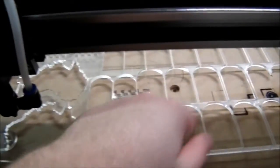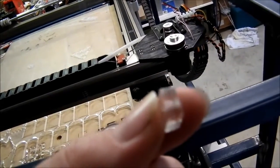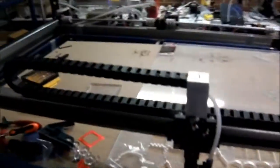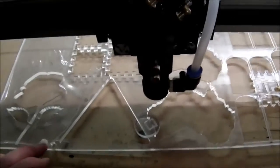Originally I was only getting about 2 millimeters per second reliably, so all the earlier pieces were cut at 2mm/s, which took forever. I just cut this one out at 6 millimeters per second. The edges are okay — not perfect — but it's only a 40-watt laser, plus it's a cheap eBay tube so the beam divergence is poor and it's probably only doing maybe 30–35 watts. Typical cheap stuff, but it works.